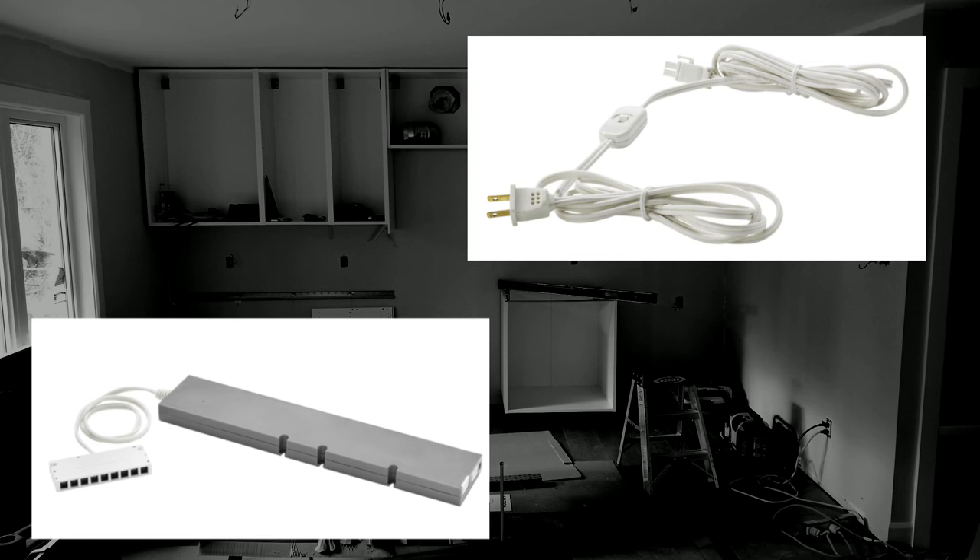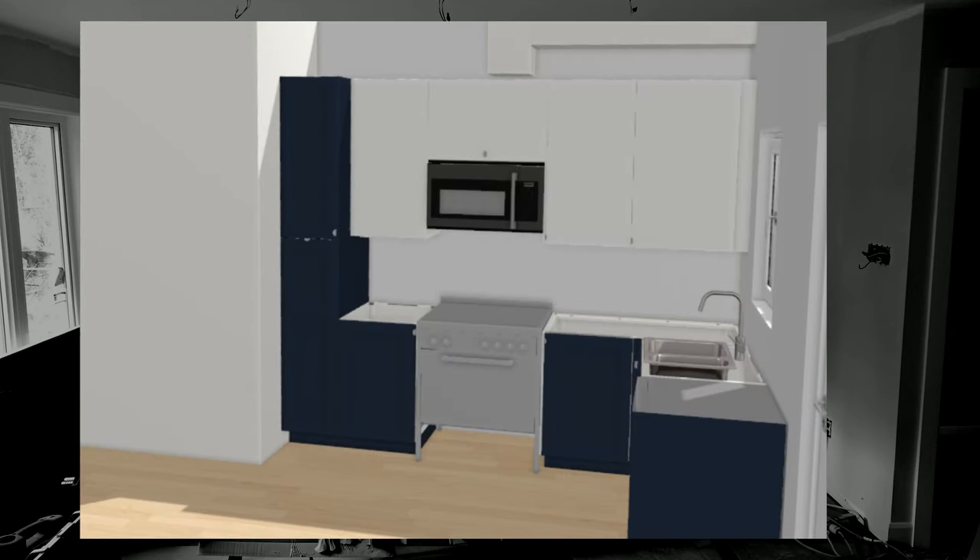So where do we put the receptacle where we can plug in the lights? The first option is something you really need to discuss with your electrician. If you have a microwave hood in your kitchen and you have a receptacle for that, I suggest you ask your electrician if you can plug in the lights to that one, because it's already there and those lights are not consuming a lot of power. The electricians I've talked to all said no problem — there are two outlets on that receptacle, one for the microwave hood and one for the lights. If the electrician says it's fine, you can put the power supply for the lights inside that cabinet above the microwave hood and run the wires from the lights into that cabinet and connect them to the power supply.